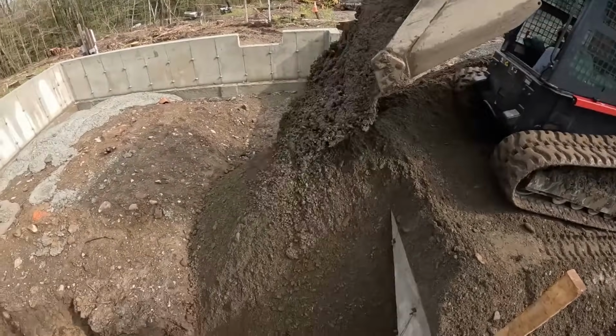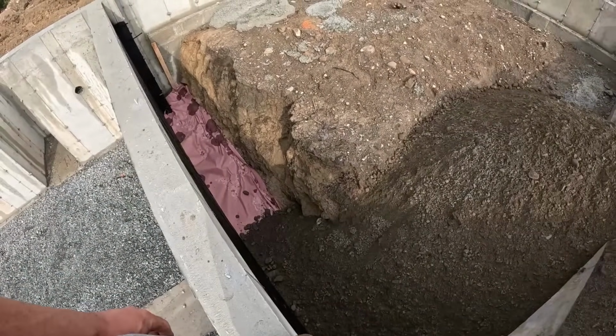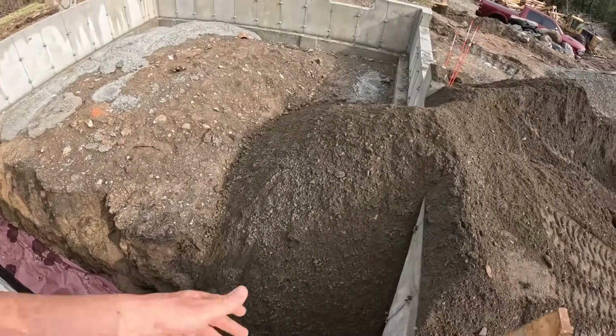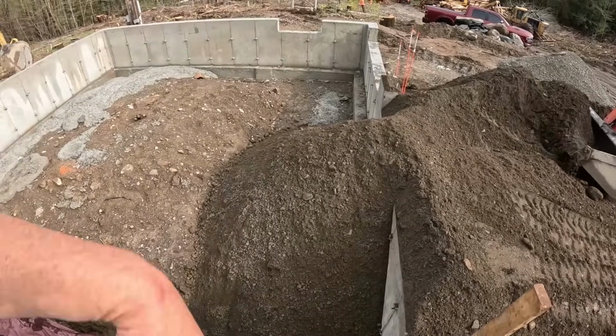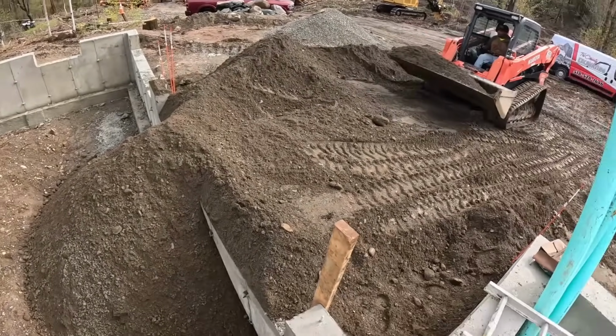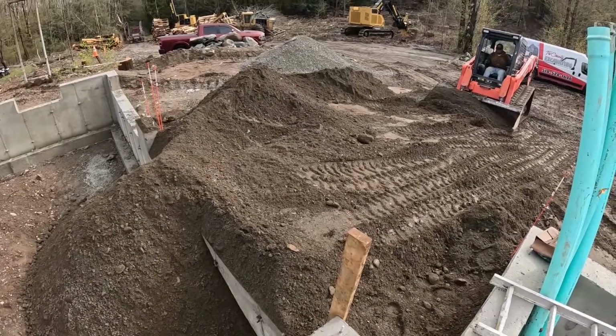That's what's nice about the diesel plate compactor. You can build this up and you can massage it down with the vibrators right into your lifts. Build this up as high as you want and to hold that wall, and then once you're in, then you just knock that down, come up in lifts. Simple and easy. A lot less using hand tools, you know.